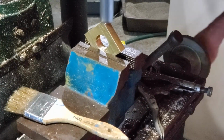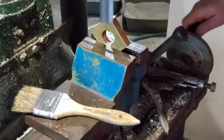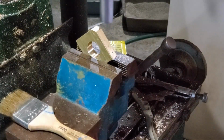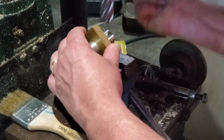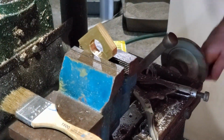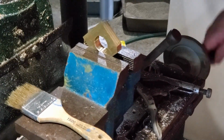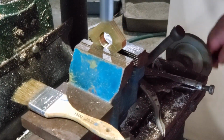And you'll notice there's a 1-inch hole in this, and the reason I went this way to begin with is the arbor I have, the larger aluminum one that I use for turning down mostly acrylic, that's the diameter of the hole for that, and that's the shaft for it. And I went that way because it is really sturdy, and because I was turning down that large piece of aluminum, I wanted to make sure I had enough meat on that it would withstand the forces involved.